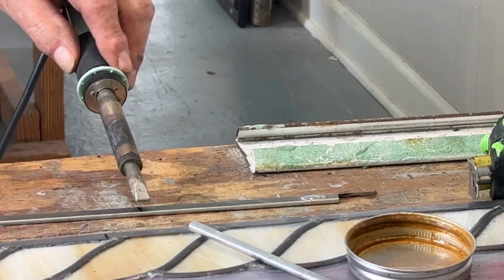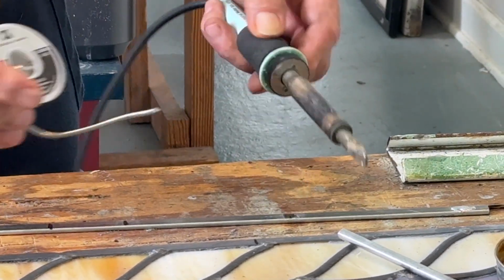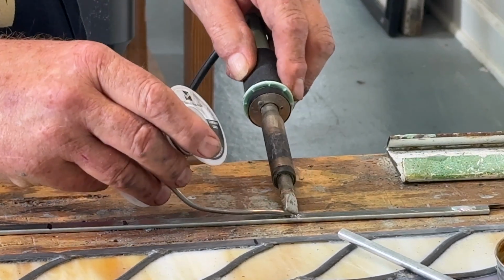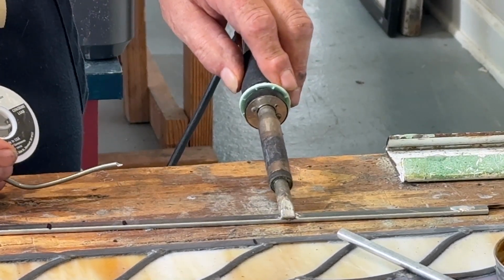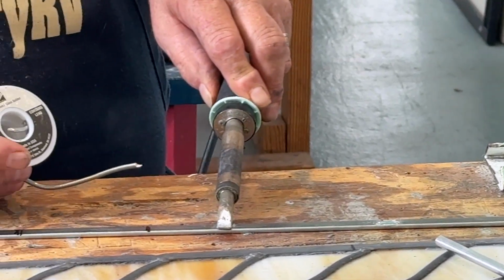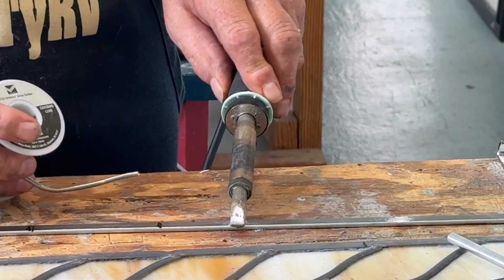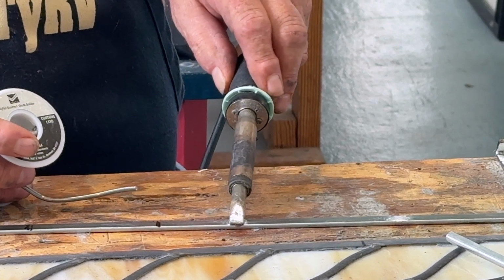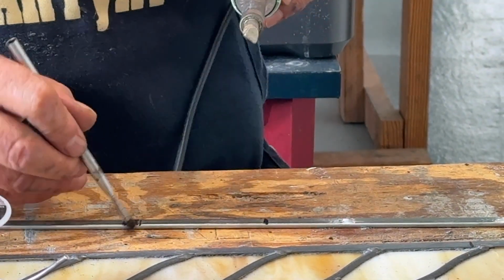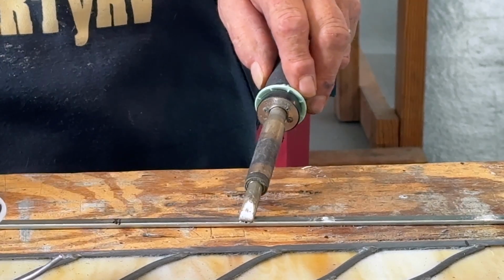And we're going to leave a little mound. Now, sometimes when you move over to your next mark, your soldering iron should still have a little bit of solder on it. But you can lay that down right there and pick that straight up. And if you don't put enough, just straight down, let it melt, and pick straight up, just like that. So remember, this is a Weller 100P. Just like that. So another little trick to ensure that it stays even better is to heat it.